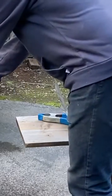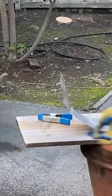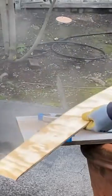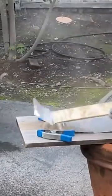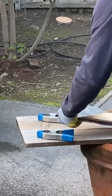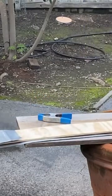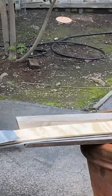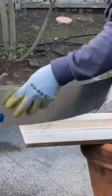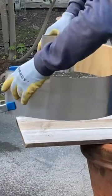So you have to do this fairly quickly once you take it out of the container. And I use a piece of soft metal to put around the wood to help with the bending, just so it doesn't snap in two. So I just put the soft metal and clamp it on there, and then basically bend it into shape. This particular one is a small diameter, so it's more difficult to do. So you just take it and bend it as quickly as possible, and then take it to the mold.